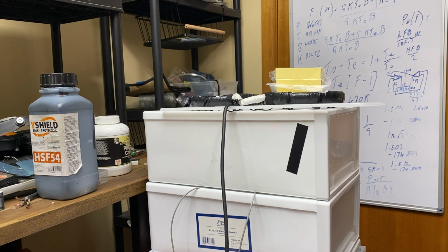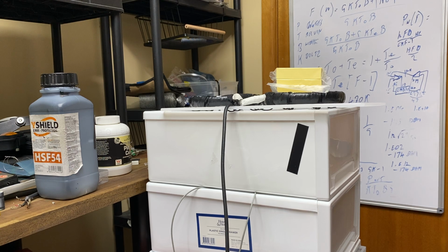Now this detector also has variable frequency put in it, but it's done through the back digital display. Because I've reset it back to factory, it goes to standard timings. The timing length is exactly the same as a factory detector, around about 30. If you put it on normal mode, you measure the 3 short pulses, about 35 microseconds long. Both detectors are the same and identical on that front.